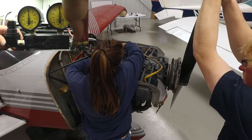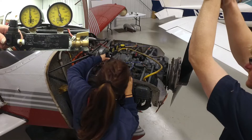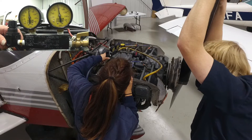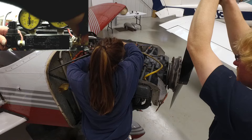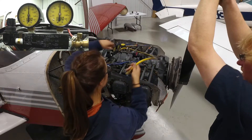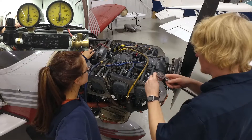Pressure on. And that looks to be 76 or 77. Pressure off. And disconnecting — we're clear. Now we'll just move it to the next cylinder down the line.